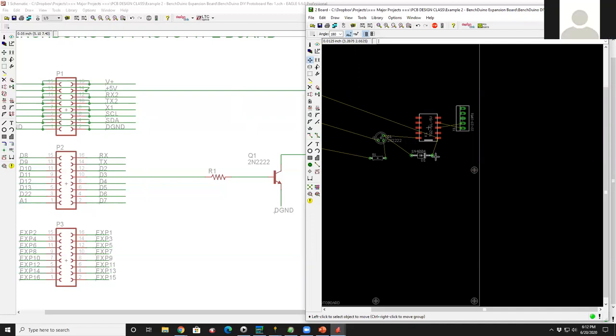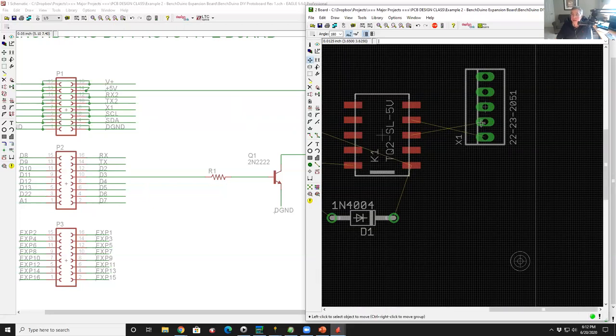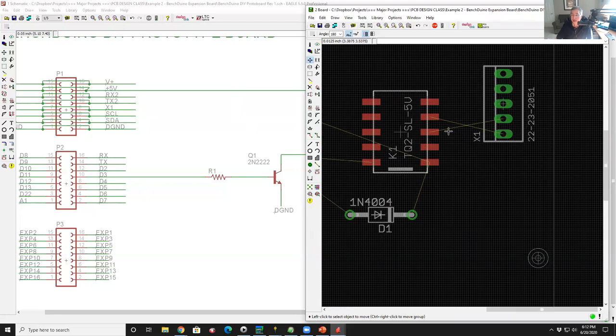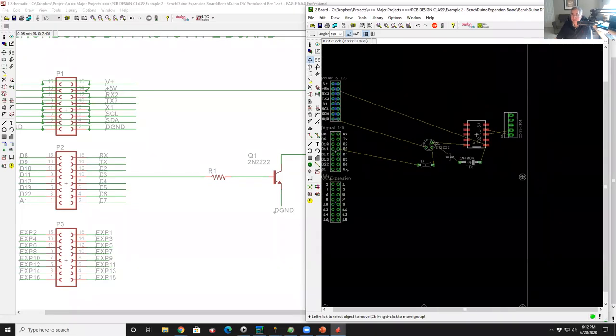Now, you're going to flip that connector so that they don't cross? We could, or we can just put this on different layers. So maybe on this connector, this rectangle on the left might be a vertical tab of plastic, and that's probably on the inside, so you probably want to leave it this way. Okay. Now, the only tricky thing is that being a surface mount relay, I have to go through a via to the other side of the board, so we'll do that.